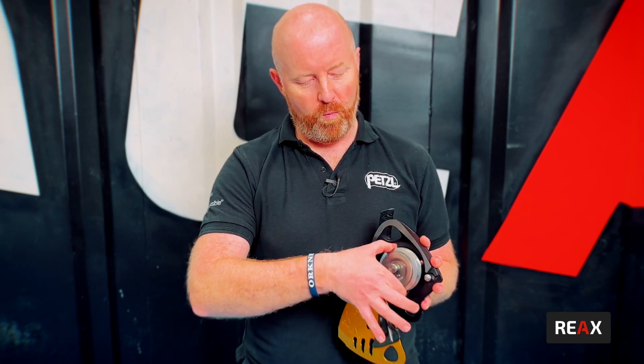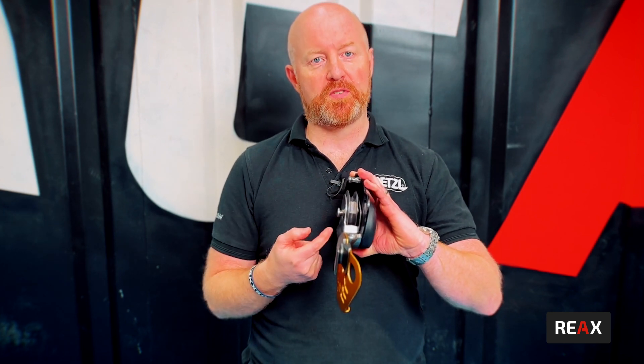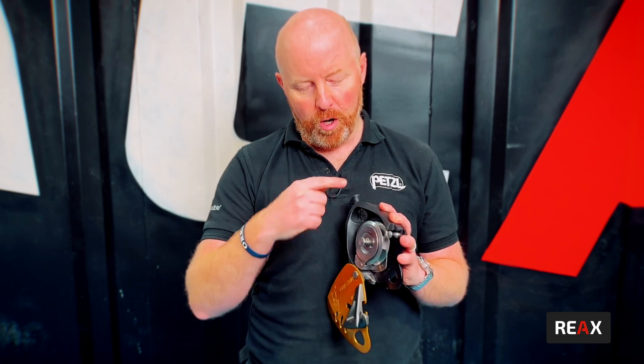The specific technology we've got in here is a one-directional pulley. You'll hear the ratchet firing there. The ratchet is actually double backed up in this one, so we've got two ratchet systems giving us double security. On the wheel, we can see multiple facets. The ratchet gives full efficiency on the pull in one direction, free running, and when it locks and blocks the other way, the facets give us lots more friction.